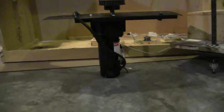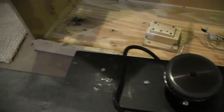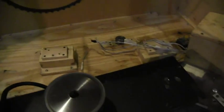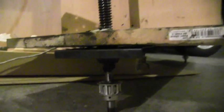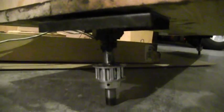This is the motor that drove the thing — you can see it is also mounted to a rack filler panel; I simply drilled some holes in it. You can see the wooden mounting blocks with holes drilled in them that received the motor, which was mounted upside down. It's a Dayton gear motor, and you can see I've attached a gear to it. Sitting over here is the entire tray mechanism — here are the threaded rods. You can see they were milled at the top, and at the bottom there's a gear attached. There's also another piece of rack filler panel that acts as a plate, with a nut welded to the bottom of it that matches the threaded rod.